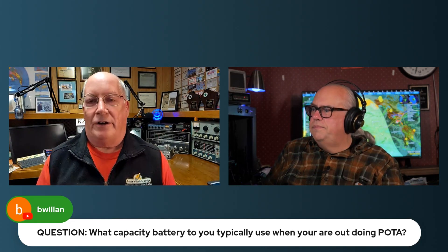If I'm only going to be there for an hour, a little 6-amp-hour is more than enough. But if I'm going to do the Wisconsin QSO party for 12 hours running at 25 or 50 watts, I better have my 25 or 30-amp-hour battery. What we did for the QSO party was take my 100-amp-hour battery that's usually in the camper and put that in the back of the truck. We ran that for the entire event with two transmitters and probably used about 60% of it.